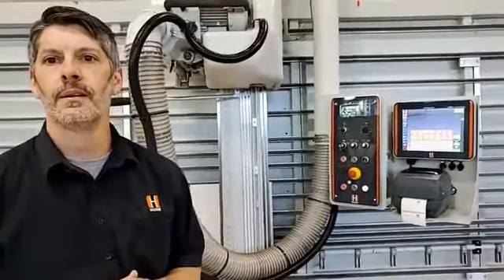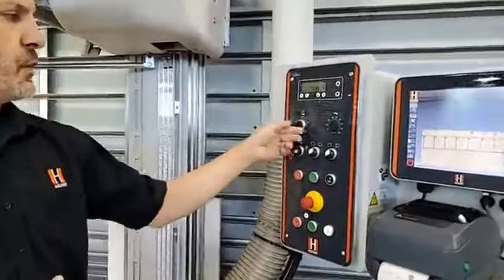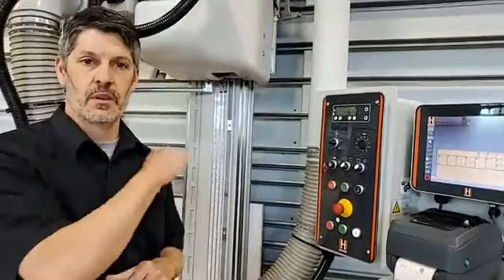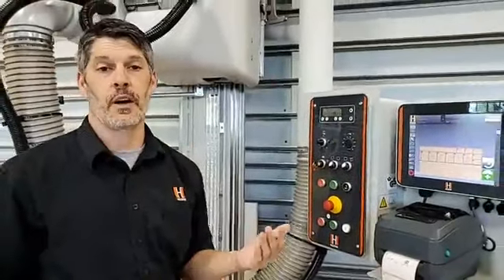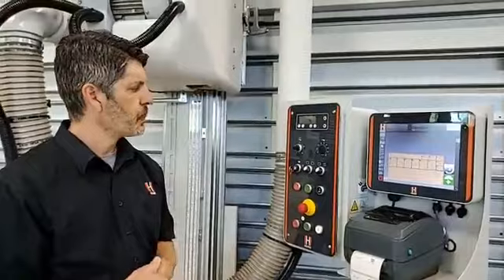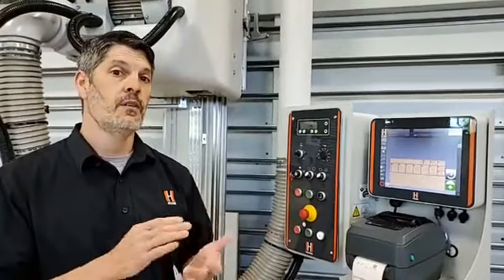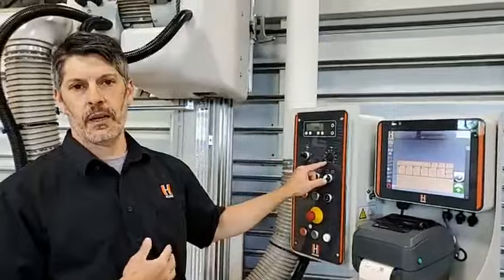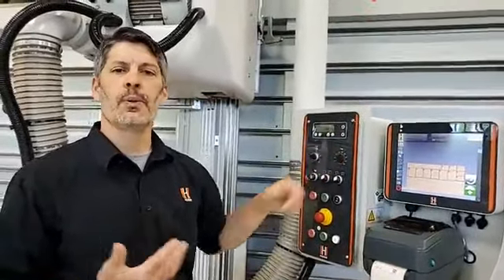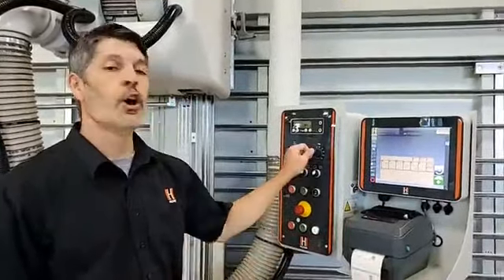Can you walk through the control panel? Yes. So here's my speed adjuster — this is for when I'm doing automatic movement, whether it's vertical or horizontal. This determines how fast I cut with the speed of the traversing. So if I'm cutting thicker material I need to go a little slower, or harder material, and vice versa for a faster material. You do have an option to have the blade variable speed: two speed, variable speed, or single speed. If you have a variable speed it will have an inverter drive, and that's what this blank knob is for — I control the blade itself. That's used for plastics, composites, metals, chalkboard, or whiteboard materials. We need variable speed for that.